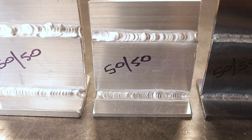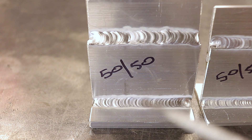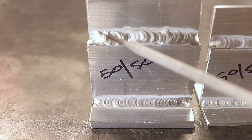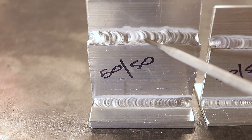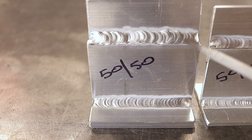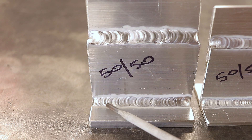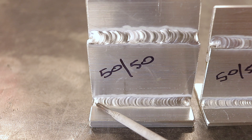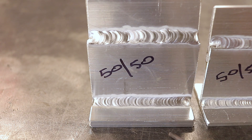Here's the quarter-inch with helium — this is where helium really excels. As soon as I lit the arc at 175 amps it started to puddle right away and formed a really clean bead. I had to get moving quickly to keep up with it. After the preheat from the lap joint, look how smooth everything is on the T-joint — I jumped on the pedal, backed off 175 amps, and it just flowed right in, really nice.